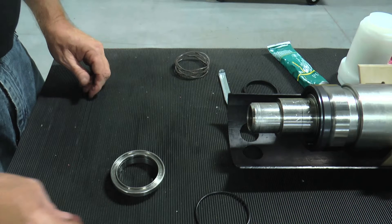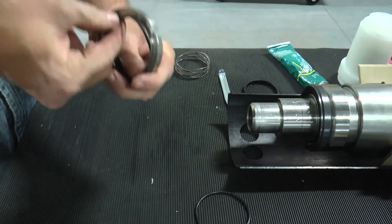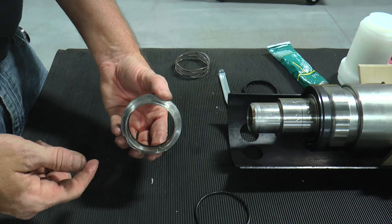The rotary seal items that make up the double mechanical seal are commonly referred to as secondary components, which include a spring, seal body, seal face, and O-rings. The seal body should be inspected for general wear on the inside and outside diameters. The inner and outer O-rings should be inspected and replaced if burrs, cuts, or flattening is apparent. The secondary rotary seal insert face should be inspected and replaced if necessary. Lightly apply lubricant to the inner O-ring and insert it into the inside diameter of the secondary seal body groove. When this seal insert is replaced, the corresponding outer O-ring should be replaced to ensure a tight fit. The seal insert should not spin inside the secondary seal body during operation, so do not lubricate this O-ring.